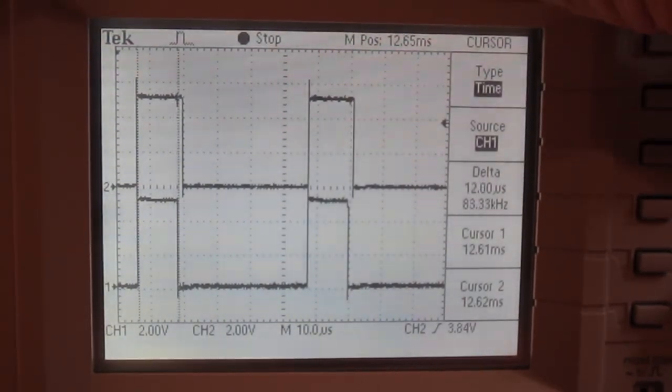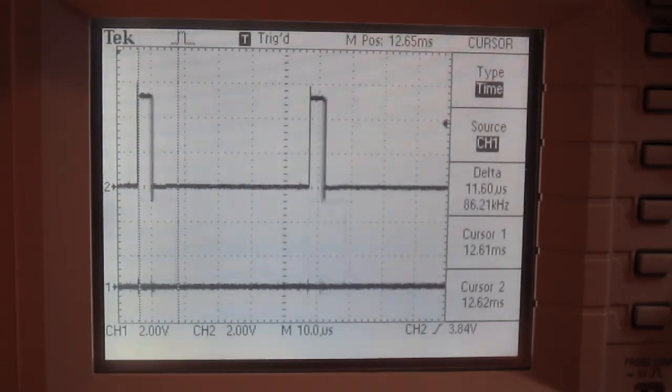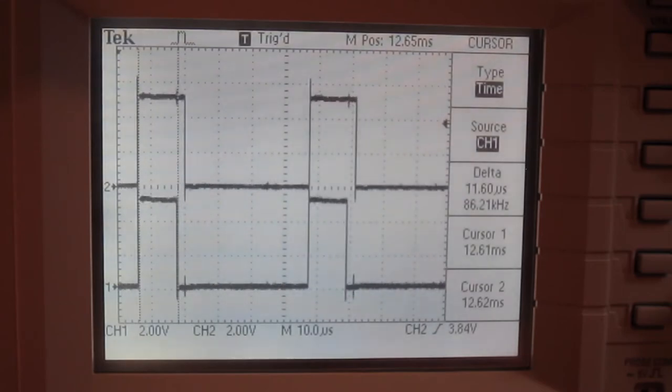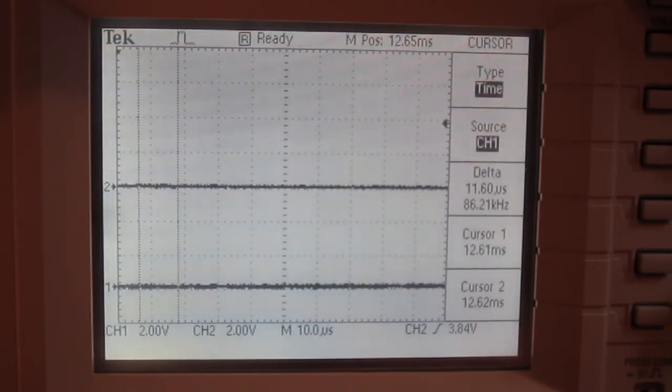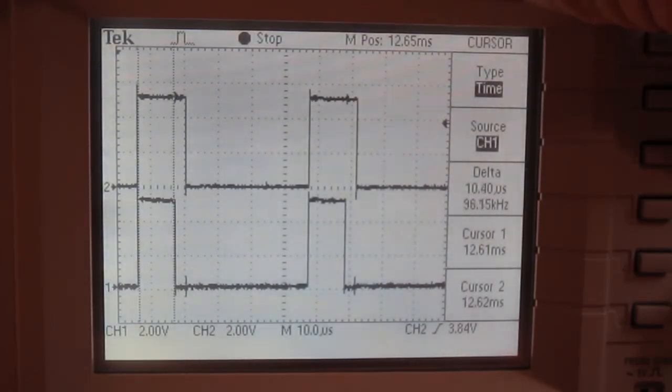And there's capturing when it's using both motors at once, so it looks like it's running the forward, and then the backwards not quite as long. So looking at the reverse pulse, we got 10.8 microseconds. Forward pulse, 14 microseconds. And then the full time period is 50.8 microseconds.